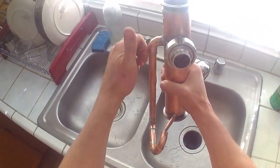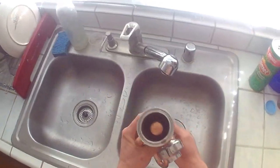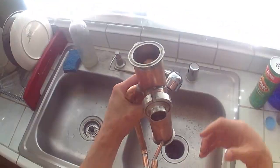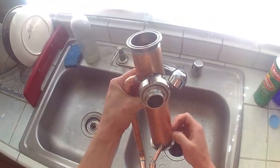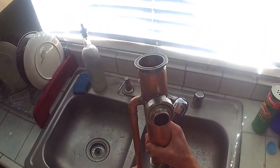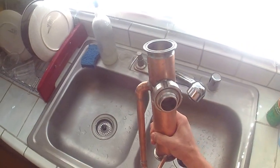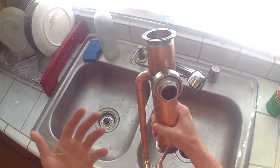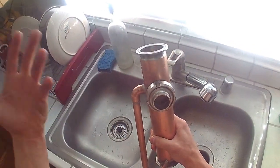You don't want steam coming through this pipe or else your thumper is being bypassed and it's not working. To make sure you're doing it properly, I'd recommend draining the thumper body and filling it with a little bit of water. That way, this pipe will stay cool when it's primed and you'll know that your thumper is working properly. Once you know that it's working properly and you know how to prime it, filling it up to here will give you a better thumper effect.